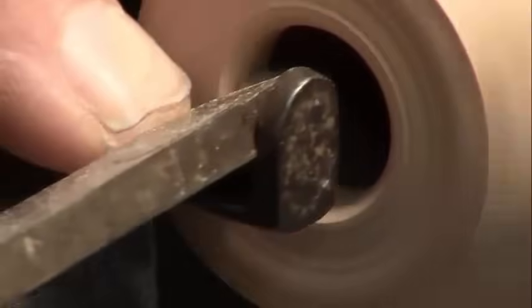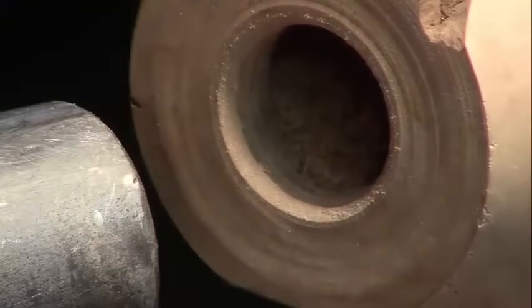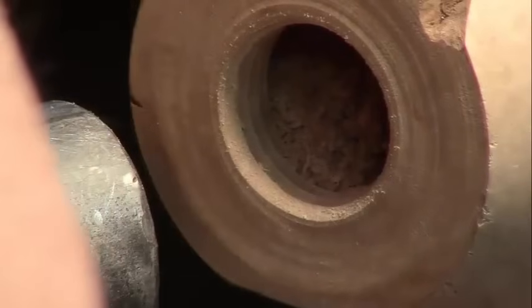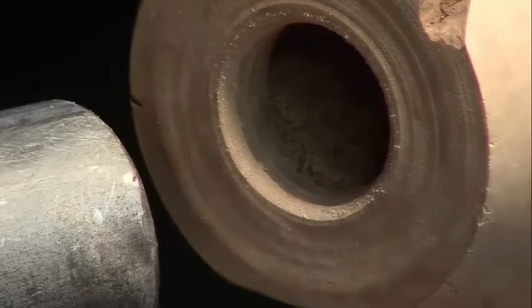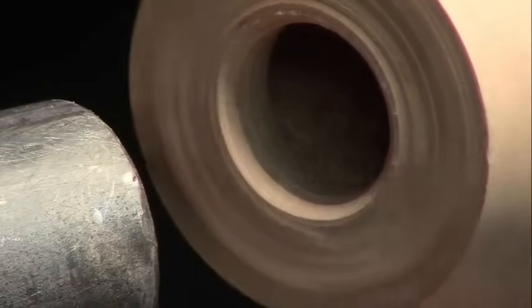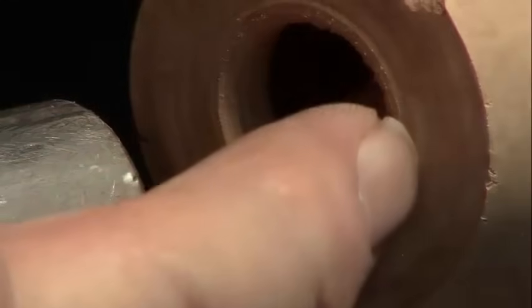It's fairly important that the surface in here is parallel to the lathe bed — the ways. If it tilts this way you'll only catch on the first thread; if it tilts the other way you end up with a pipe thread. It's really easy to cross thread at the start and it will only lock at one place, and that place it locks may not be airtight. You really need something to touch on this flat surface to be airtight.